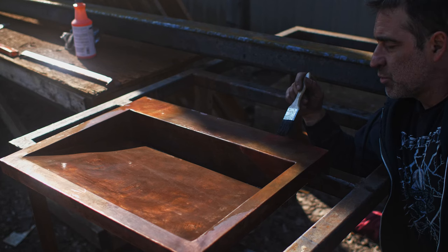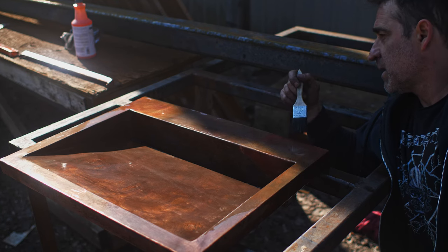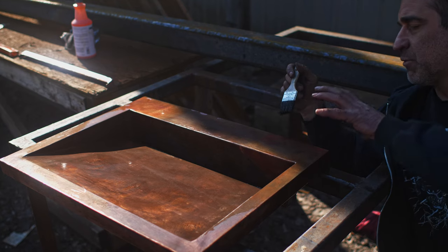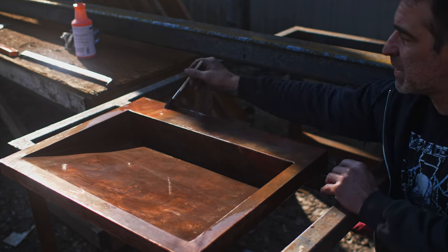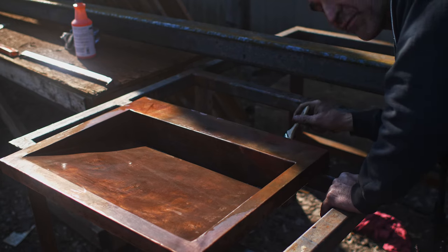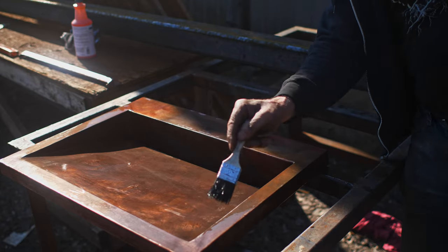The bottle tells you to arrest the process when you start seeing the blue come in. The purple colors — you want to stop it before it goes too far. I find once you freeze it in, it tends to go a little bit farther than what you want, so it's kind of a guessing game to try to get everything to balance out. Luckily, we're going for a very mottled finish anyway, so I'm looking for consistent inconsistency — that's always kind of my goal.